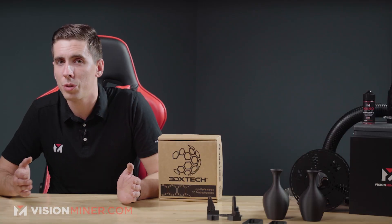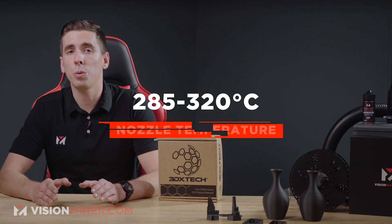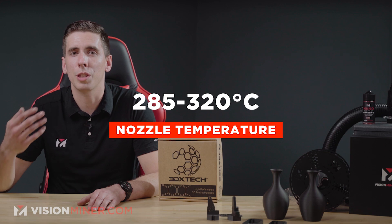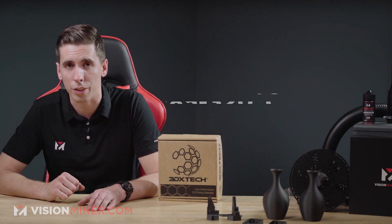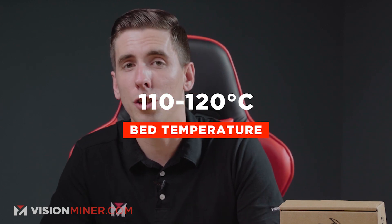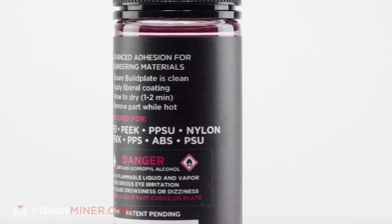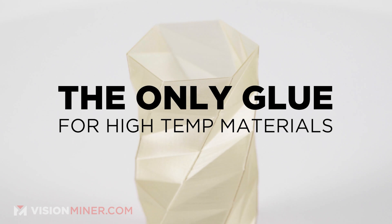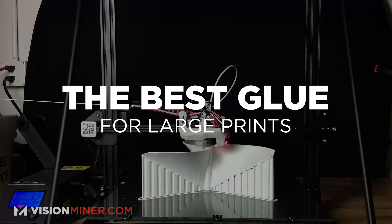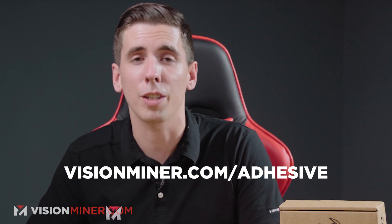What kind of machine do you need to print this filament? You need a nozzle that can go to at least 285°C, up to about 315 or 320°C depending on the actual printer. As far as bed temperature goes, you need at least 110°C to around 120°C. We get the best results using our nanopolymer adhesive on the plate — it works awesome for all nylons with no brims, no rafts, nothing like that, on PEI, glass, carbon fiber, whatever type of print bed you have.